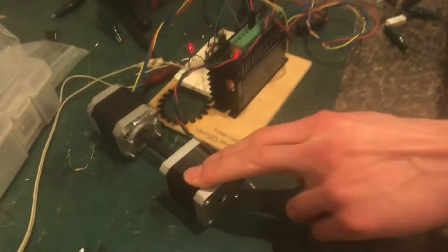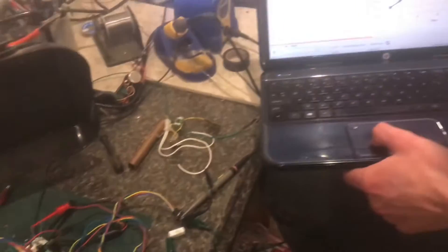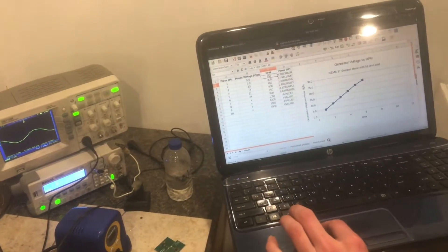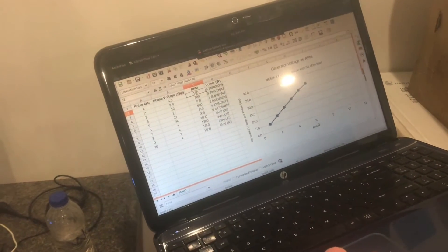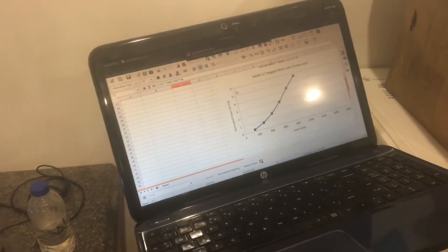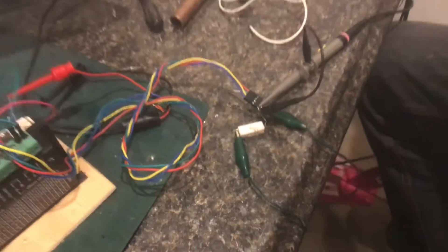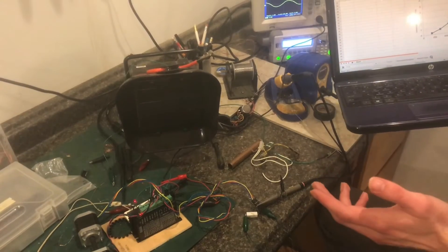A stepper motor is a pretty good way to do that, and I want to show you what's going on on my computer because my battery is pretty low. I'm spinning the stepper motor and measuring the voltage, then I used Excel to chart it and converted it to this graph. At about 900 RPM, it produces 5.5 watts of power, and that's per phase — per coil — and the stepper motor has two coils. So we can actually get about 10 watts out at 900 RPM, and I don't expect to spin much faster with the water wheel, so 900 RPM would be plenty — it would be very fast.